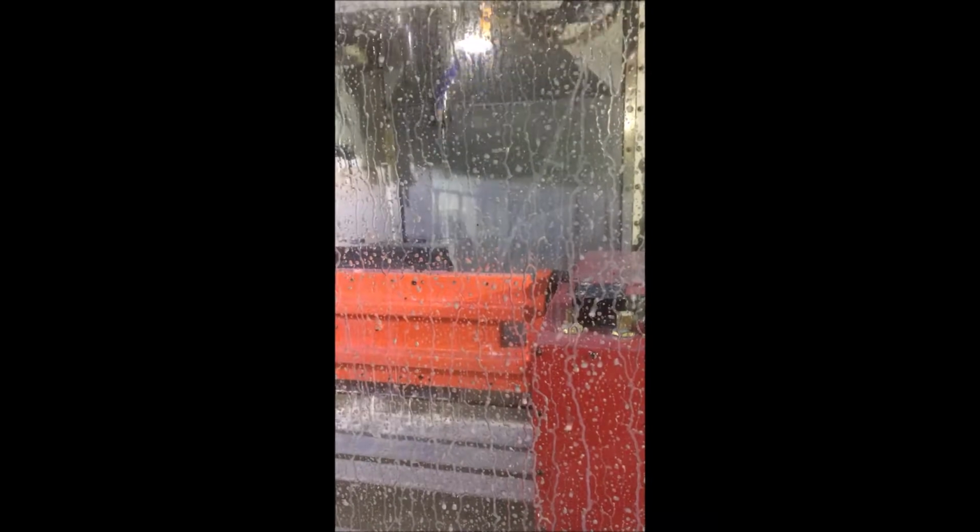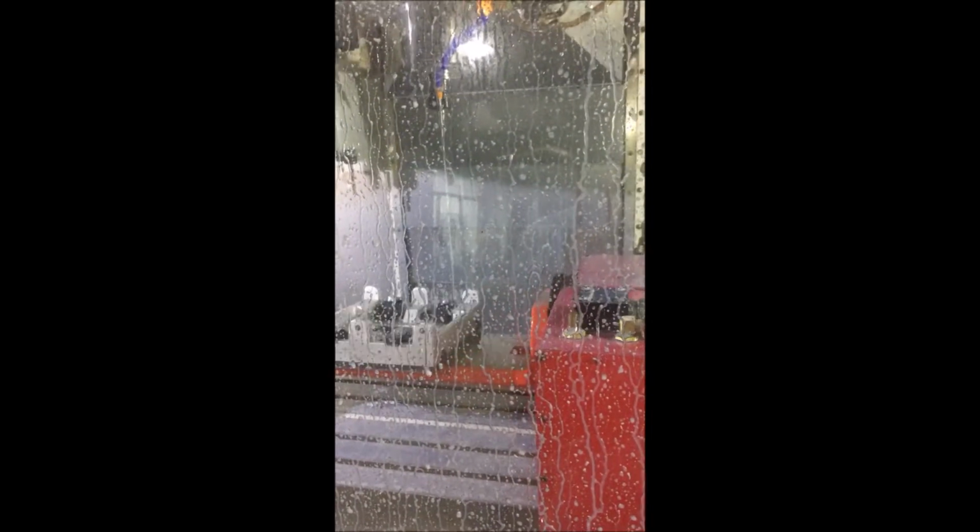One of the things I was thinking is that it might be more efficient in the program if I didn't do a tool change here and bore this other side, if I just flip the table, but this indexer is not very fast, so it probably is about a wash. Because that's 50% of rapids on the indexer right there. It's not very fast. But hey, I can't complain.